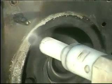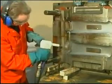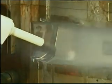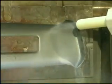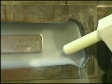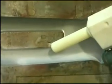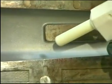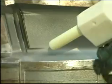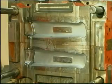Of course, cleaning on the production machine is not always necessary, as in the case of this plastic injection molding tool used to make visible components for car interiors. The need for cleaning is relatively infrequent and can generally be planned between production runs. However, because of the leather-grained finish on the part, the tool must be cleaned to maintain the quality of the grain effect, as with use this fills up with silicone release agent. Conventionally the tools would be cleaned with a mildly abrasive media, which over time softens the definition of the grain effect. Using dry ice, the release agent is removed without any loss of tool material, and the need for tool refurbishment — which can cost as much as the price of a clean surface blaster — is totally avoided.